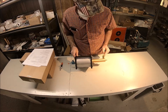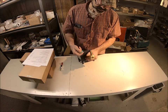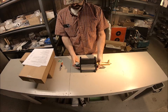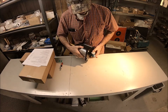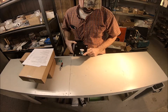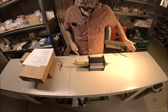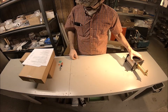Both ends have your one-eighth Foster male nipples, and there's an arrow here showing the out direction. It's a one-way check valve so the air can only go up, it can't go backwards. This is the booster pump — you press to activate, and when you let up it stops and goes back. That larger quarter-inch quick disconnect allows you to use a standard shop compressor to drive it, or you can do it as a standalone setup.